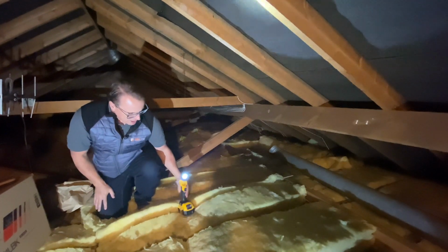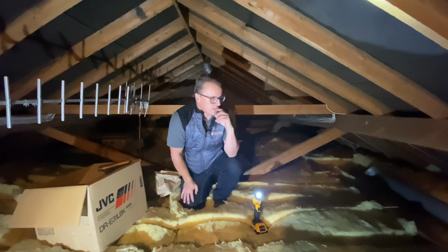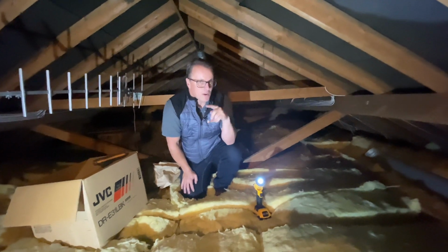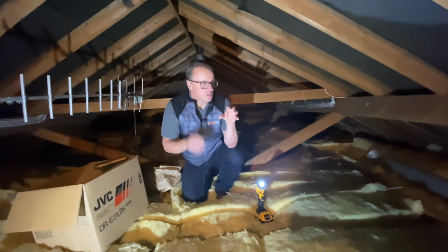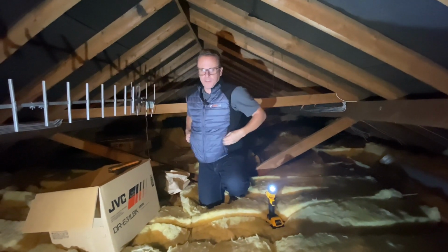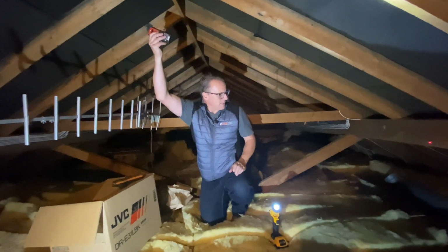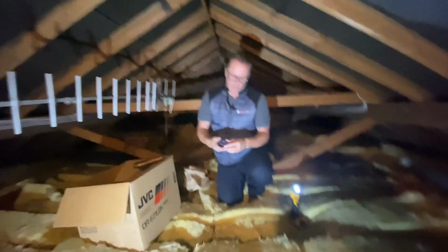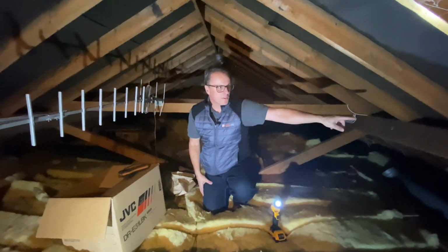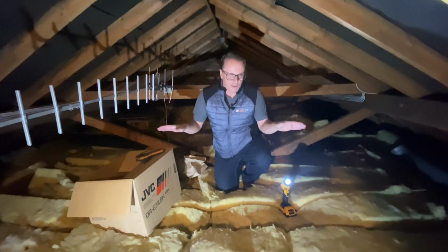So the only shape that cannot be distorted is a triangle. And what we're trying to do in any roof space or any structure actually is create triangles if we can. So if ever you see trusses in the roof space or even on the back of a lorry, you'll see they're basically broken up into a series of triangles, so nothing can then be distorted. So what we've got here, we've got one big triangle for the roof, but if we only had the one big triangle, our rafters would be spanning quite some distance. They'll be spanning around 3.3 meters, which is way overspanned for these. So the purlin's popped in the middle. And then the collars then provide another triangle here, and the collars help prevent the roof spreading out.